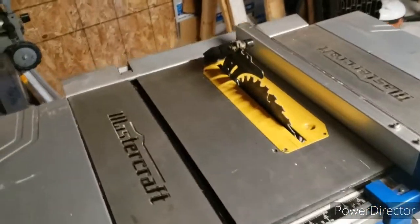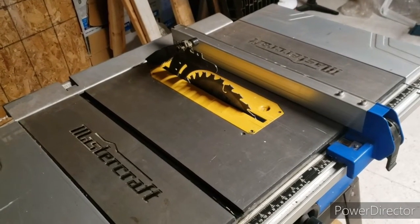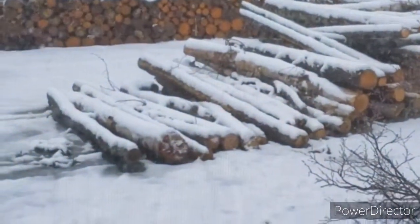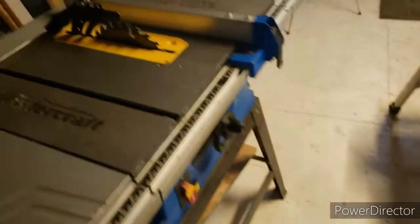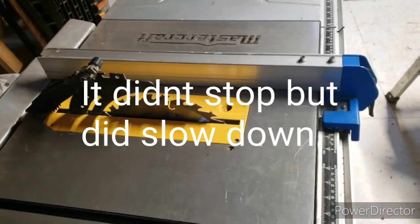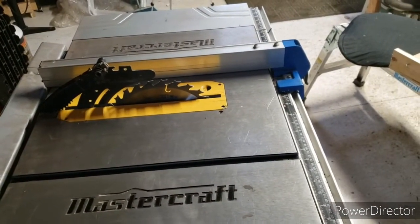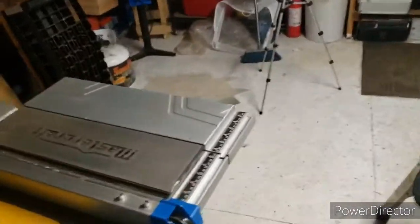This saw is a 10-inch, single-bevel, 15-amp brushed motor. I will say it is a brushed motor, but I've never bogged this thing down. The closest I came was when I was making some coasters out of a small log — just cut down and wet. It slowed down a bit, and as anybody knows, wet wood is gummy and sappy. But it never truly bogged down, so motor-wise it seems to be a great motor.